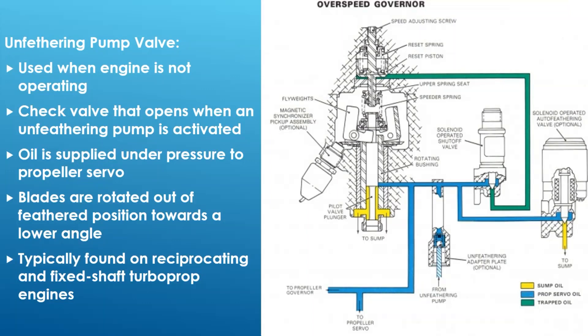The TPE-331 is our fixed-shaft turboprop down in the lab. We cannot start that engine if the propeller is in a feathered position - there'll be too much resistance, the engine core will not be able to spin up fast enough, get enough airflow, and it'll over-temp during the start process. If for some reason it shuts down and goes to feather, or sometimes maintenance actions shut it down without the full shutdown procedure, there are pins on it that lock the prop into fine pitch position during a normal shutdown.